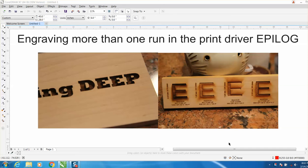Hi, it's me again with CorelDraw tips and tricks. Tonight's video is about engraving more than one time in the print driver — this is for Epilog, and I'm sure other drivers can do the same thing. When you want to go deep with an engraving — I showed this off at the Las Vegas show and somebody said it's so sharp, it's crisp — and it is, because I kept the focus on the top so if there was any expansion of the beam it went lower. This is like a 3/8 inch piece of wood and I almost went all the way through it.